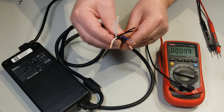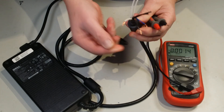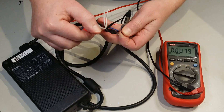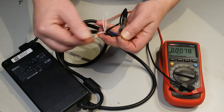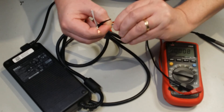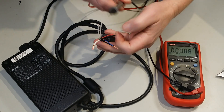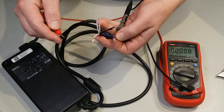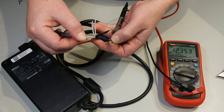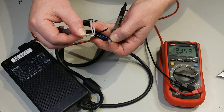I don't know what the red wire's function is, but if in doubt we'll just insulate it. As it stands, hooked up like that, you'd probably guess the black is negative and white is positive. But with mains power connected there's no voltage — it has to have an enable line. Basically if you twist together one of the blacks with the blue wire, you'll have voltage. I've just heard the power supply start up. Putting my meter on it, we've got 12.35 volts — just over 12 volts, ideal for running Halloween props or Christmas display lighting.